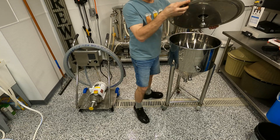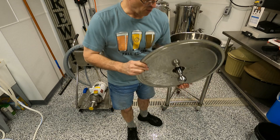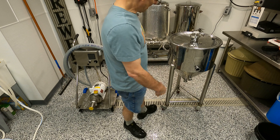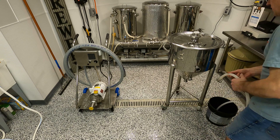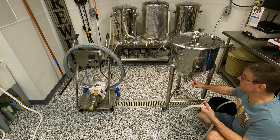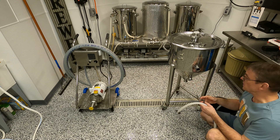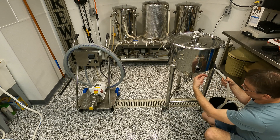This is kind of what it looks like inside there. When I apply pump pressure this is going to spin under that water pressure and scatter water throughout the entire interior — paint the whole inside 360 degrees. So we're going to fill that bucket up full of hot water, get the pump recirculating, and then after a quick hot wash we'll add some cleanser and let this thing go for a bit. This fermenter has a couple of other orifices on it — a TC connection for the beer outlet and another one for the thermal well. While the CIP ball is spinning and spraying inside it's going to try to spray out of those, so I just put a little cap over them with a piece of tubing that goes down into the bucket and serves as the return. We just recirculate this way, so those ports actually get a wash too.